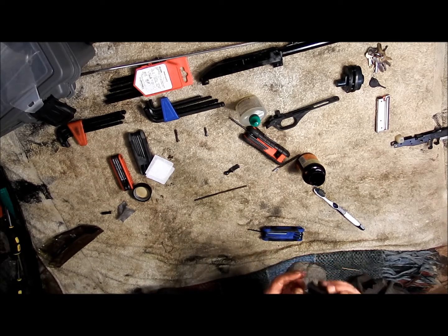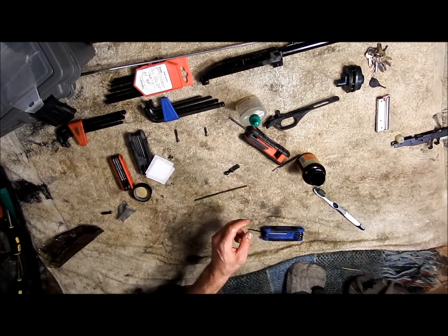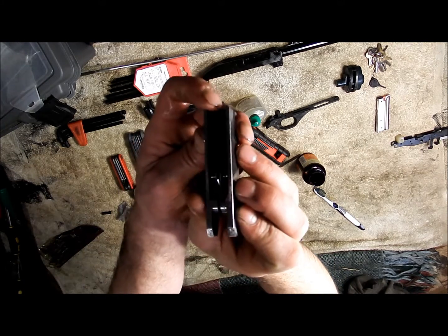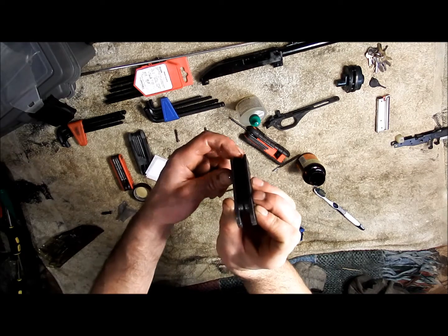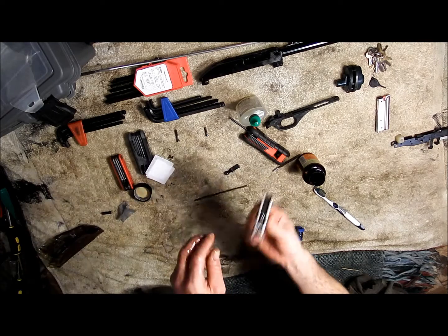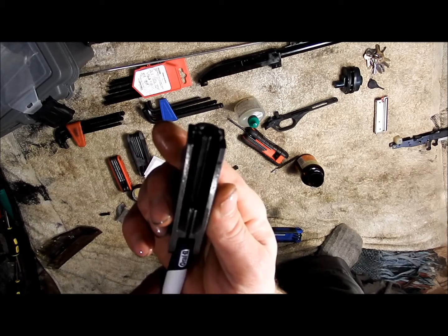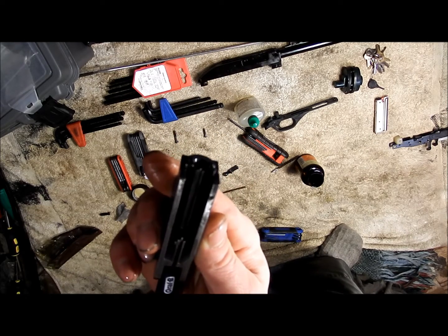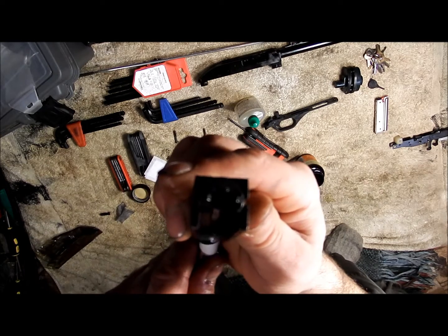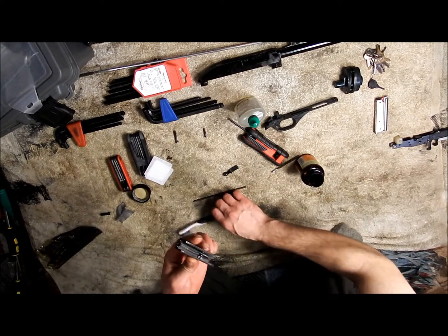and what you want now is this firing pin to flow freely in here. When I shake it, and when I drop it, I don't even know if you can see this, but there is a firing pin in here with where the hammer hits right in this notch here. And you basically want, here I'm just going to do this, so it pushes there and it pushes your firing pin forward, and you want your firing pin to be free. So that needs a little bit more scrubbing, because when I push it up it does catch.